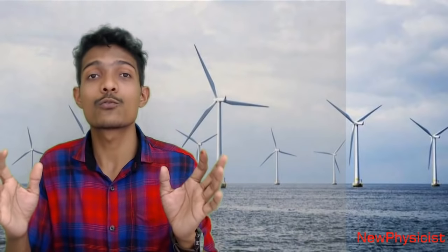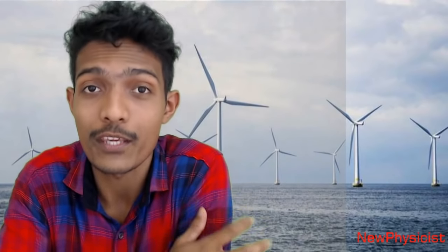face the propeller. Right. And there is another mechanism called the pitch control mechanism, but I haven't implemented that mechanism into my project because I thought it is not necessary in my case. Okay, the pitch control mechanism is used to control the speed of the wind turbine. Wind direction and the wind speed change all the time. The yaw mechanism is used to manage the wind direction, and there is this pitch control mechanism to control for the wind speed.